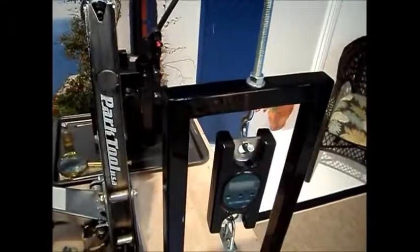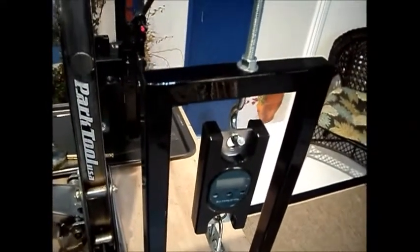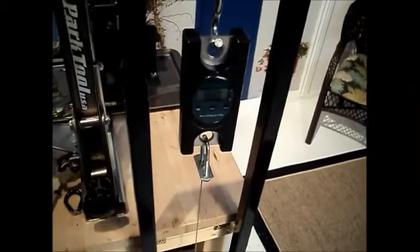Here's the frame, all painted, with a mounted hook fed through the stability bar so we can do shorter spokes, and a threaded eye at the bottom. Two U-bolts and a plate on the U-bolt — I've drilled through the plate and chamfered it for spoke nipples on both ends.